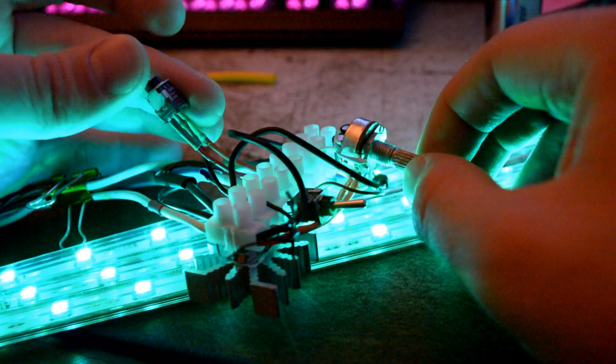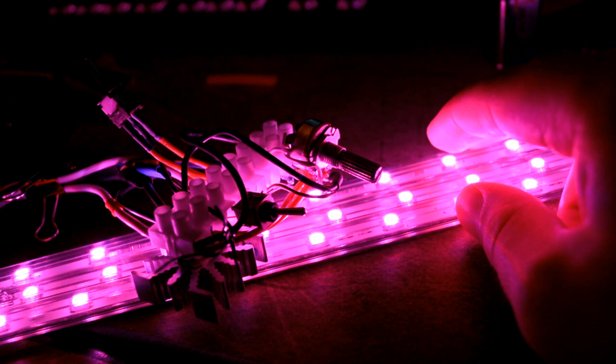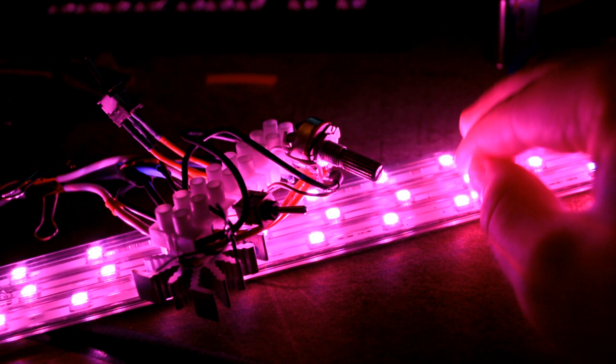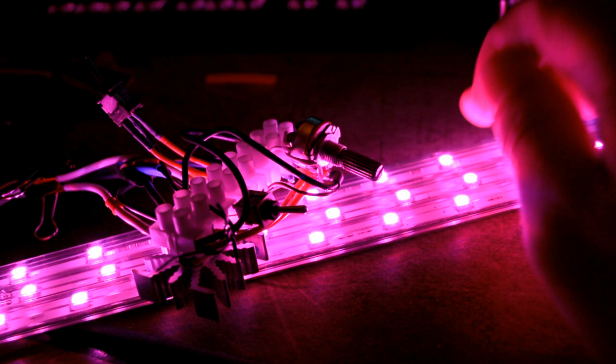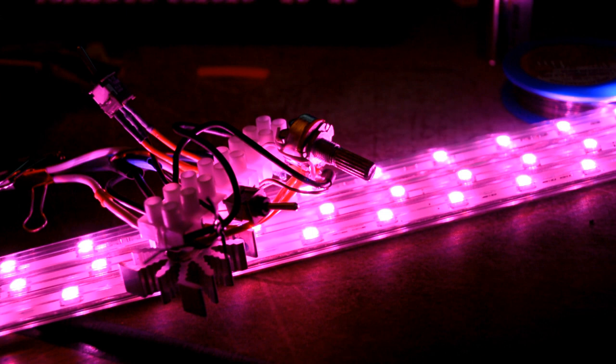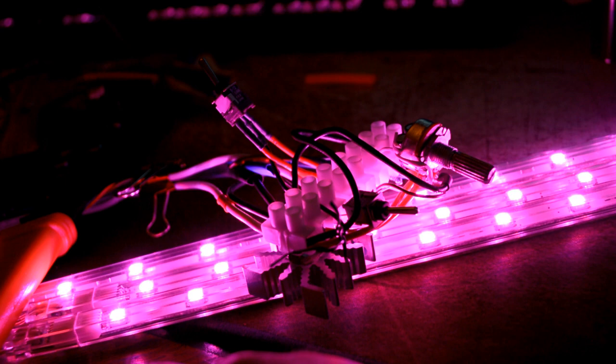Well, I think it turned out pretty cool, and of course I will do like a final thing when I buy the negative LM317 so that I actually can control the volt output of these rather than the input, as these respond to output, which is basically we are sending electrons into red, green or blue directly. Why my original setup didn't work of having three of these circuits kind of bundled together. Oh well, this works pretty neatly, and I'll show you a little picture of how this is set up.